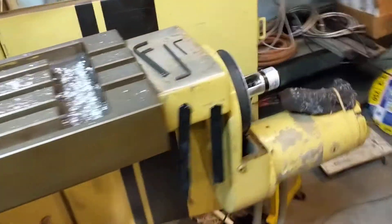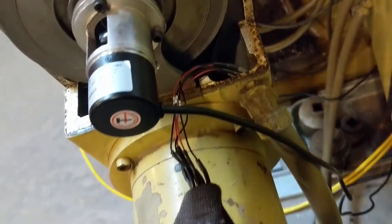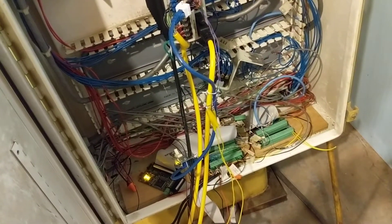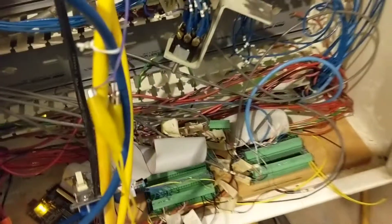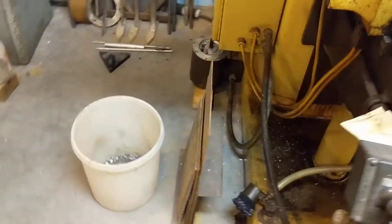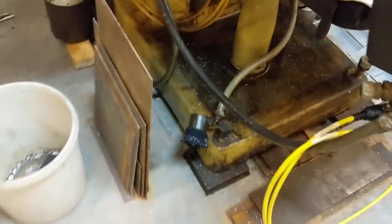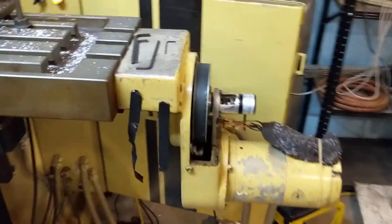It turns out my couplers were broken. This is the old resolver — I took the resolver out but left it all wired; the blocks are just hanging in back there. You can see it between the two gray ribbon cables — that's one of the blocks for probably the Y axis, the other one's hidden. I swapped out the resolvers for encoders, went full encoders on the whole machine. That's the Y encoder down there — I just put old socks over them to protect them until I was sure the encoders were working.